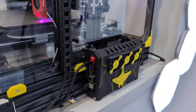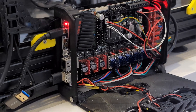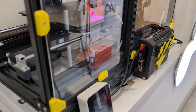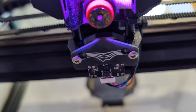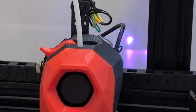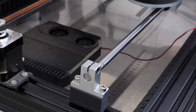Before we get to the speed test, let me show you what makes this printer different from stock. I swapped out the stock board for a BTT Manta M8P V2 with TMC2209 drivers, which gives me smoother movement and more control over my prints. This Cartographer 3D probe lets me create a perfect bed mesh and keep a perfect Z offset every print. I've upgraded to a Stealth Burner extruder paired with a Revo hotend, which is great for quick nozzle changes and high-quality prints. Linear rails make movement more rigid and precise, reducing wobble at high speeds.